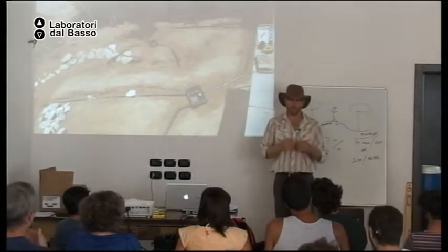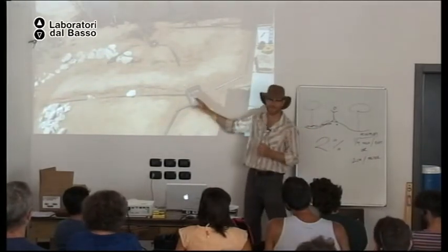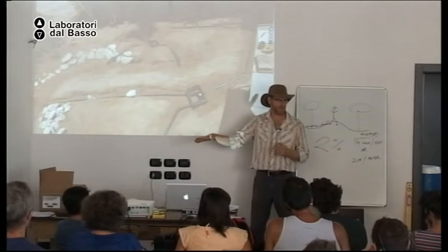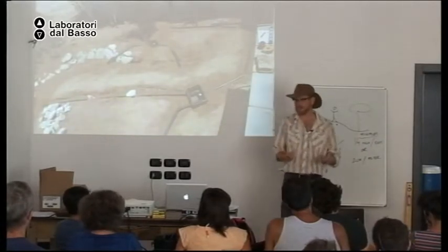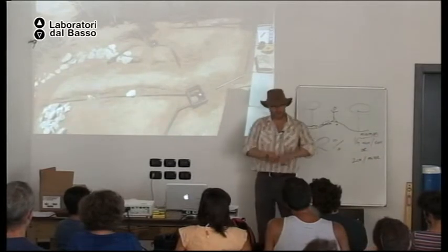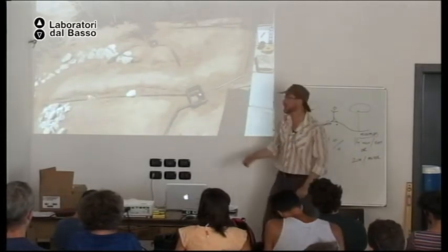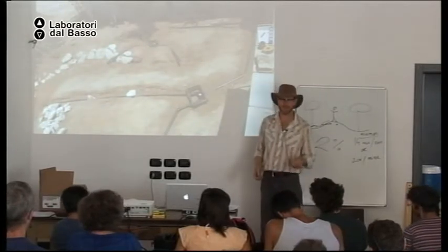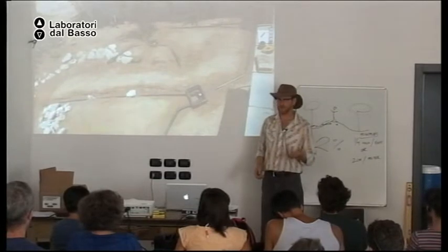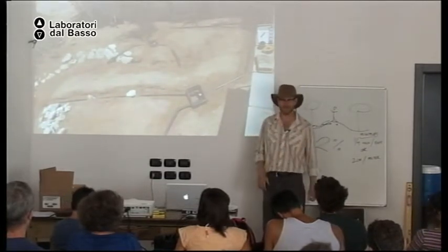So at my own house, I don't glue it when I'm more than 3 meters away from the house. Because maybe in the future I will change something and I can just disconnect it and reuse it. But if I'm doing a job for a client, I glue it. Because I don't want to risk it coming apart and them calling me to come fix it.